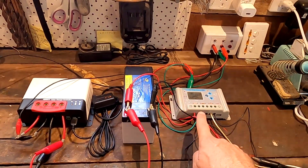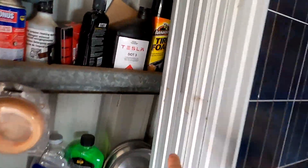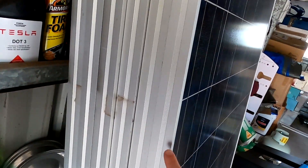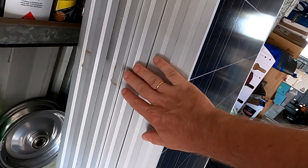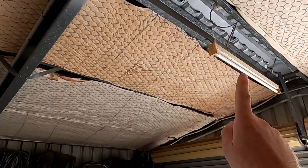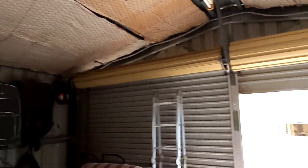To be honest, I'm not a big fan of having just one charge controller. I'd rather have several solar charge controllers for different solar panels on different locations on the roof - different strings. We've got about six panels here and I don't want to run them all from one solar charge controller only. I'll put panels in series, three each, and connect them to different solar charge controllers - three panels on this roof side and three panels on the other side.